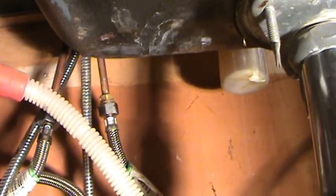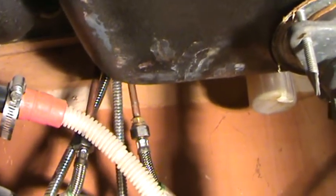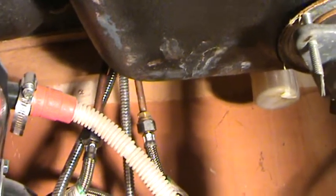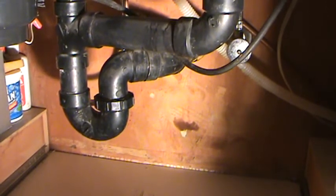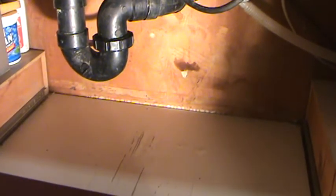That was the nut I tightened up and it looks pretty dry from here. I'm not going to call that good just yet — I'm going to let the water run. When I test out a leak, whether it's on a trap, gate valve, or a fitting, I'll let it run for at least a couple minutes, maybe longer, before I tell somebody I've fixed it. Had I let it run a little longer and it would have dripped, I could have fixed it then.